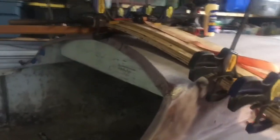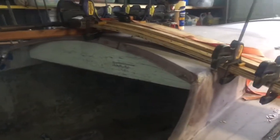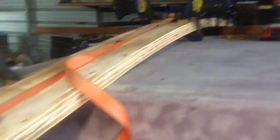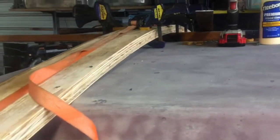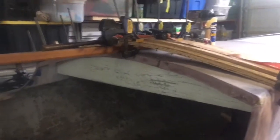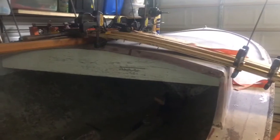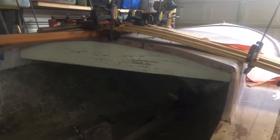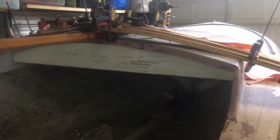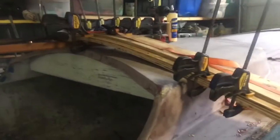What we're going to try and do is build a custom piece that'll go up underneath here and be hidden. We're going to make it out of plywood — it's a lamination, basically three-eighths inch plywood, three of them laminated together using Titebond. I wanted to over-bend it slightly so when I push it up inside, it gives better shape to the cabin top and puts it under compression, making it stronger over time.